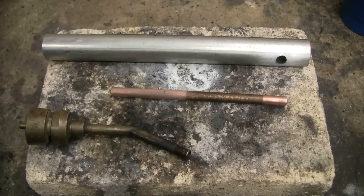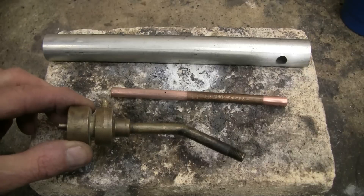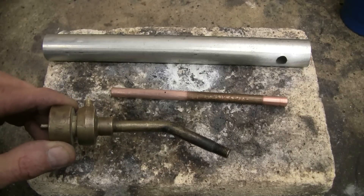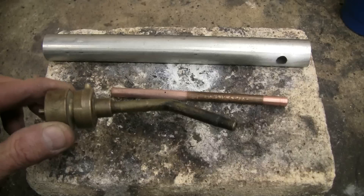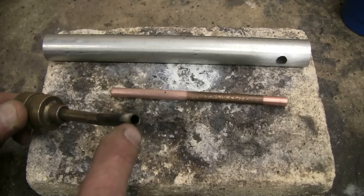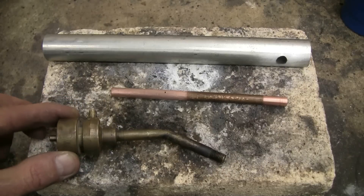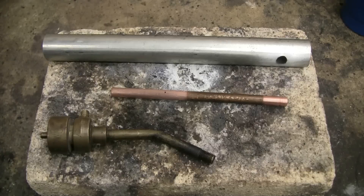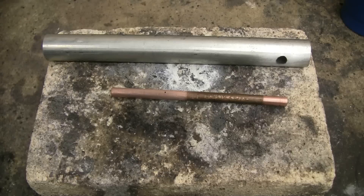Shown here are the parts we need to make this burner. If you're going to run off a normal MAP gas or propane torch tank, you'll need a tank valve like I've shown here. This came from an old torch and the orifice plug has been slid out the end, so this will essentially just serve as a tank adapter and valve. If you're going to run your burner off a barbecue tank, you wouldn't need this — you'll just need to get together whatever you're going to use to hook your burner up to your barbecue tank hose.